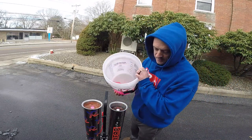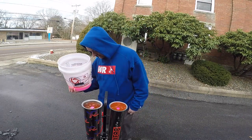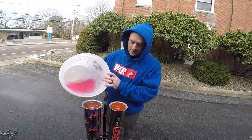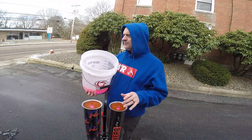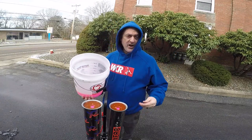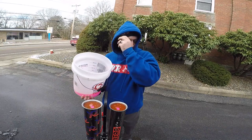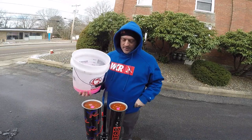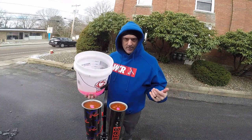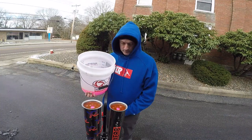I'm just checking to make sure it's not leaking anywhere out the bottom. If you don't clip your waste hose like this, it will drain out the bottom. If you're storing this horizontally, you'll want to make sure the waste hose is vertical in the air somehow, or cap it. What about the other filters — the carbon pre-filter and the resin? Does that need to get winterized? Not necessarily, but at the end of your season you're going to want to change your carbon filter out.